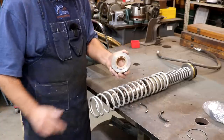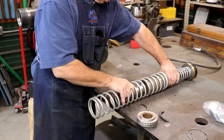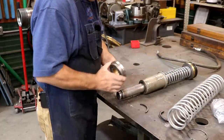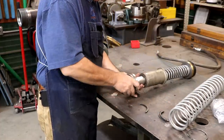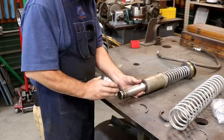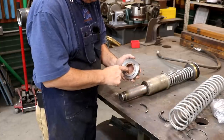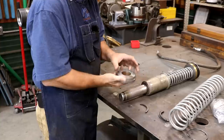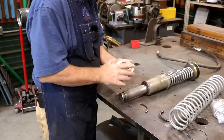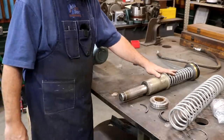Now on this bottom piece there's also a bronze bushing. This fits up over the ram and guides it through the bottom. While I'm at it, we're going to put a new piece of brass/bronze in there, get it turned to the proper size. This has got some wear in it — again, while we've got it apart, might as well do it right. So what we need to do today is hone this cylinder, install the two brass pieces, put on new seals, and basically reassemble this.